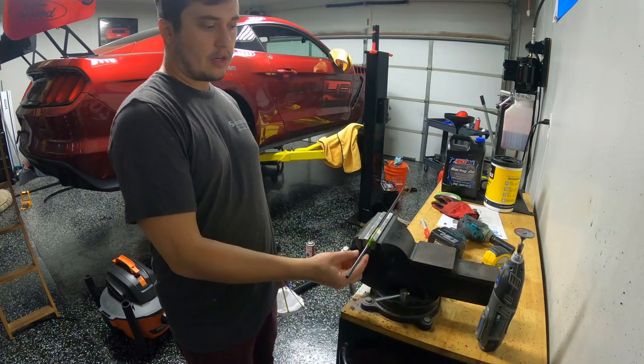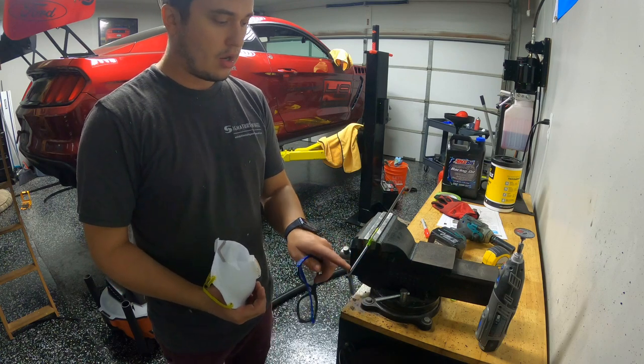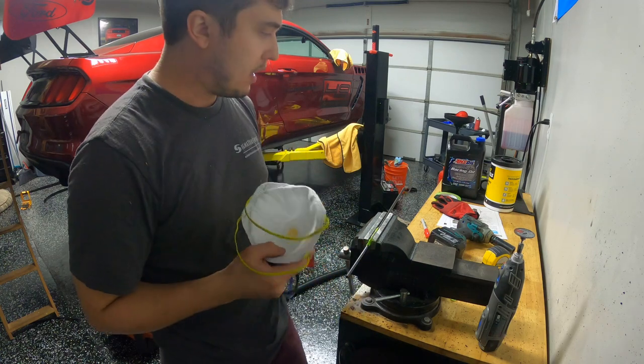For cutting the rods, I tried a couple of different ways. I saw that sawing the first one created splinters because it's a fibrous material, so I recommend something like a Dremel with a mini cut-off wheel — it makes it super easy to slice through. I'm using some tape here to ensure a clean edge on the part I'm keeping, and I'll be wearing a mask because of the sharp tiny fibers.